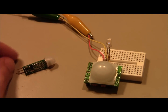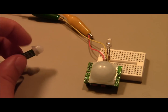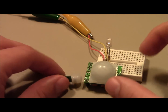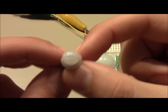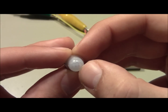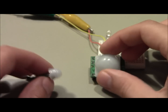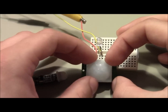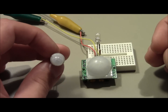These things are really impressive. Setting one up and pointing it across the room, I can be 20 feet away and move just 6 inches and it will detect it. That depends a lot on these plastic domes — if you look carefully you'll notice it has all these different circle-y patterns, which are actually infrared lenses. The element is fairly small, but by putting this big dome on it with this lens configuration, it focuses a much larger area onto the sensor, making it a much more sensitive motion detector.